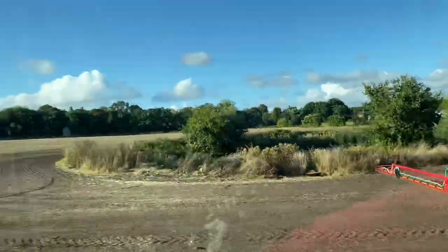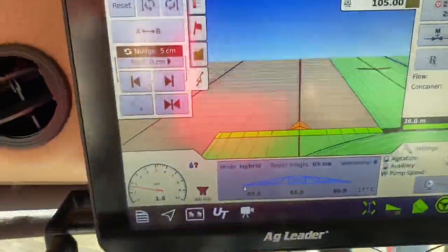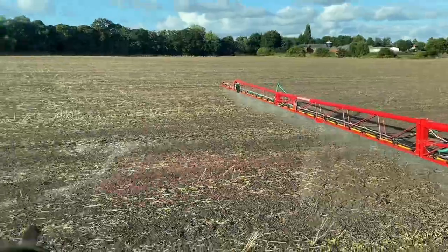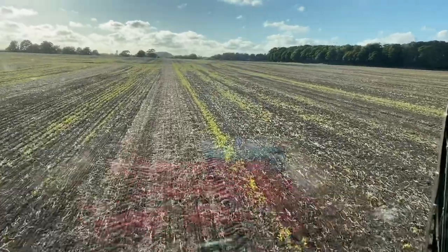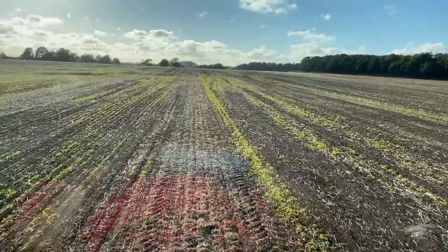Spraying around the pond is really easy with GPS - you can see it's turned off those sections and as we go out it'll start turning the other ones on. It's rained overnight as well so it's just nice and moist now - using less water today so we can get more in one go. We've got 100 acres in this tank. Spraying off the oilseed rape volunteers - they'd be dying now, they were sprayed off on Wednesday, and hopefully in a week it'll be green with wheat.